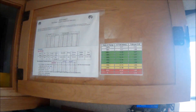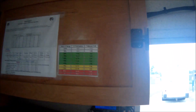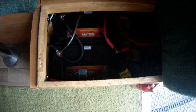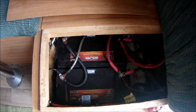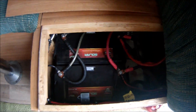It takes a lot of power to charge them up, but compared to flooded lead acid batteries, they seem to discharge power a lot more efficiently. So I'm sold on AGM batteries. Keep your connections clean, make sure your fuses are in, and life is good. That's my 8,500-mile update traveling around the country with the VMAX tanks solar batteries.